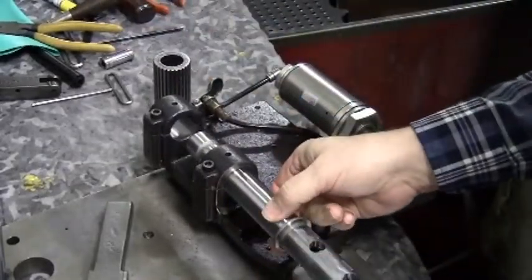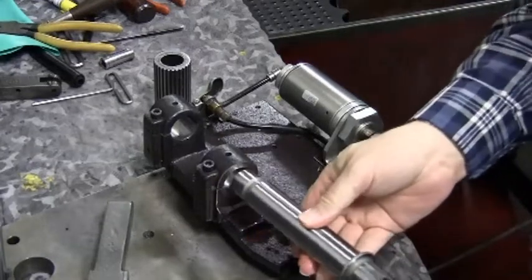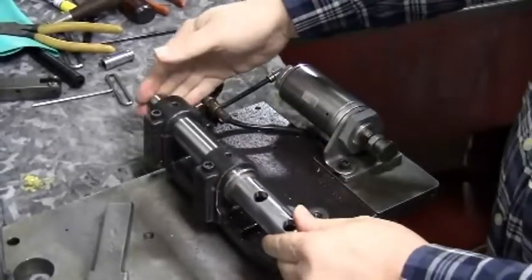The last thing is to remove the spline pulley, called the chuck hand wheel, off the end. The chuck shaft would then slide out. You may need to loosen the saddle bearings, but that usually is not necessary.